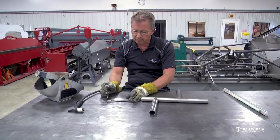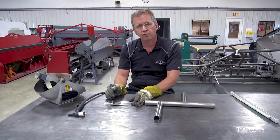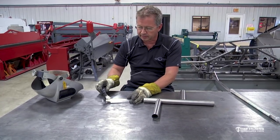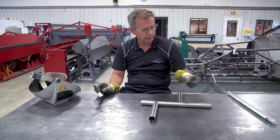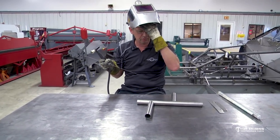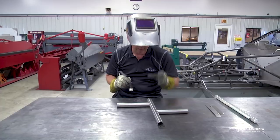Because with a weld like this, if I was gonna try to go all the way down through here and weld this in one shot, I wouldn't be able to get enough argon coverage over this weld to post-cool it. When I'm done, I turned it and just flooded that area with argon — same thing I'm gonna do here. Most likely it'll be tubing you're welding, making some wheelie bars or some components for the chassis, or some little trick piece you're putting on the car.